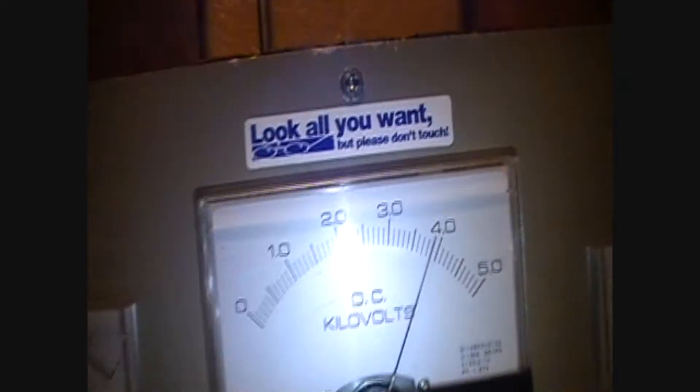It appears we're resting at about 3800 volts, and once this thing warms up it should go up past 4000 - at least that's what I read on the meter. That little clicking is a fan in there. Nothing blew up. We're at about 3900 volts on the plate. Those things aren't gonna do nothing yet since I'm not really keying it.